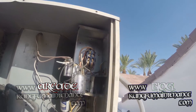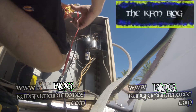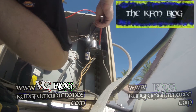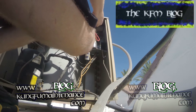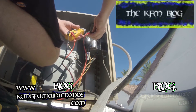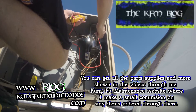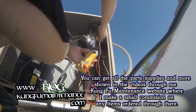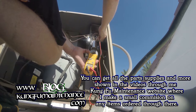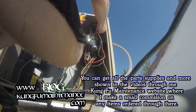The contactor is not sucked in, so we'll test the volts first to see if we've got a good point in there. I'm going to set this to volts AC. It's 239.3, so that's good. We've got good volts at the bottom of the contactor.